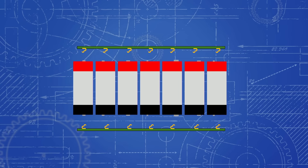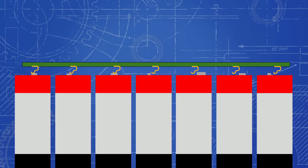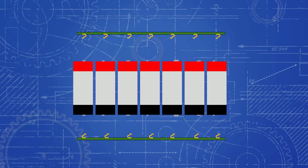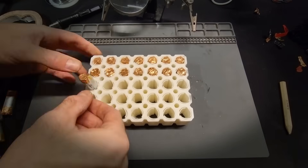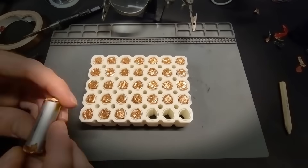As I discovered in the last video, when we connect the cells together via the PCB the odds of every cell making a solid connection with the PCB's springs is pretty small, since the cell terminals are so tiny. Here we can see that four of the cells are actually unconnected, and that is why I've applied some conductive copper tape to both ends of the cells to make my own big terminals — giving us a nice solid connection across all of the batteries. This time I'll show you a bit more of the preparation to make sure the copper tape actually adheres nicely.